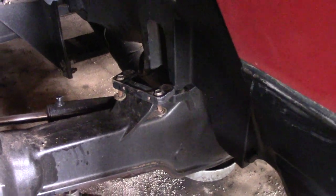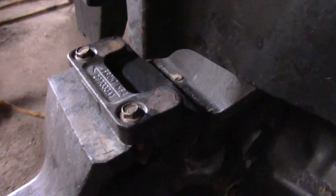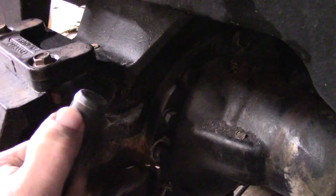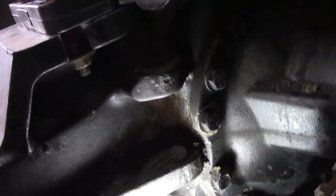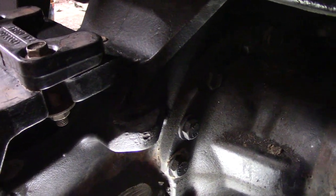I had to pull the stopper out of this side just to get a little more room. I don't want to go all the way until the axle touches the frame — that stopper is in there for a reason. Even so, the pin still just barely doesn't have enough room to drop in, so I'll just cut the very tip of this pin off. Instead of having a slight protrusion, it'll be flush — still plenty supportive.